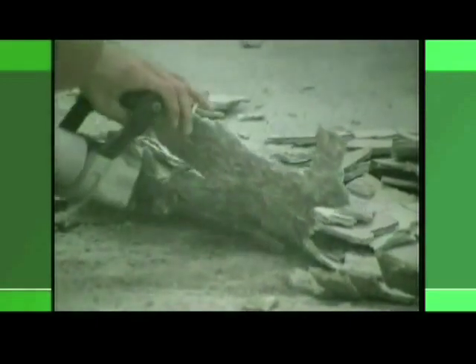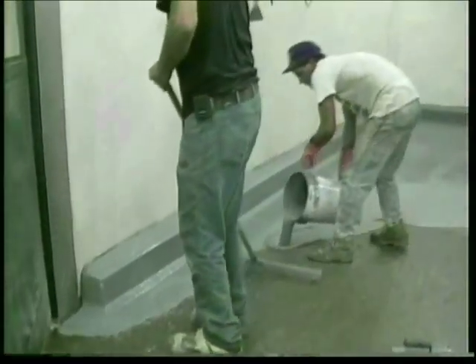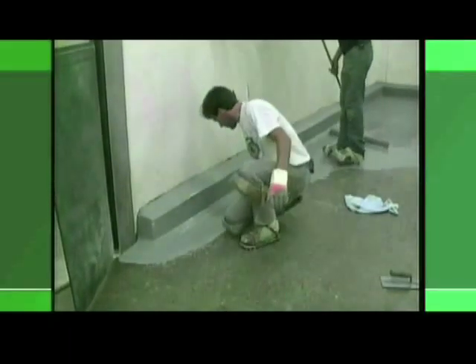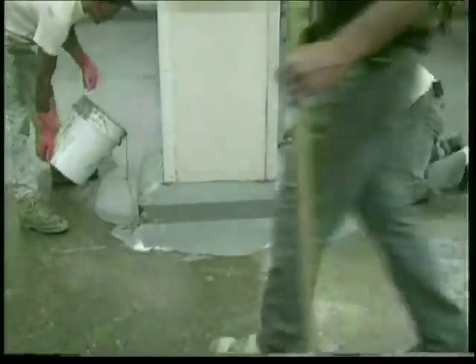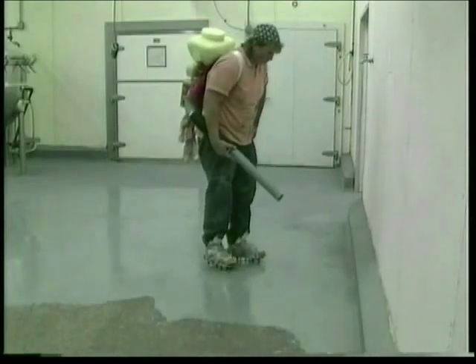This meat and food processing plant job outside Cincinnati, Ohio, entailed the removal of a failed delaminated resinous floor. Notice there is no real bond to the concrete substrate, allowing a bacteria buildup. The owner chose a colored quartz floor system. After removal, scarification, and shot blasting, we poured a self-leveling acrylic overlay. Then we broadcast to rejection the colored quartz sand onto the floor and the perimeter bumper curb. Notice the technique we use for the curb and cove base — a real piece of cake. This procedure makes a lot more sense than hand troweling of a curb or cove separately with thickening agents.